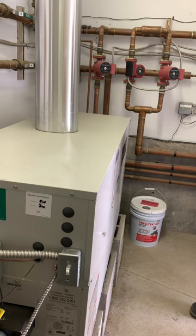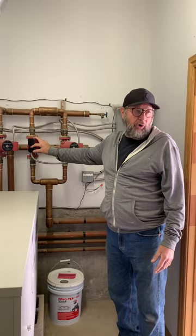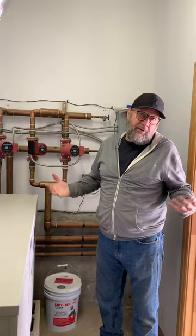Well, especially when it will contribute to knowing the facts about if that's truly the issue out there. If it worked before, and you've got new pumps and the air's out of the system, it will work again. So that's why I asked, did it ever work. And same thing, usually the farthest thing away, in a lot of cases, is the top of the driveway, and that's where the air collects. So they purge all the air out, get a strong enough pump to get up there and back, you should be fine. Okay. I know you've got plenty of everything else.